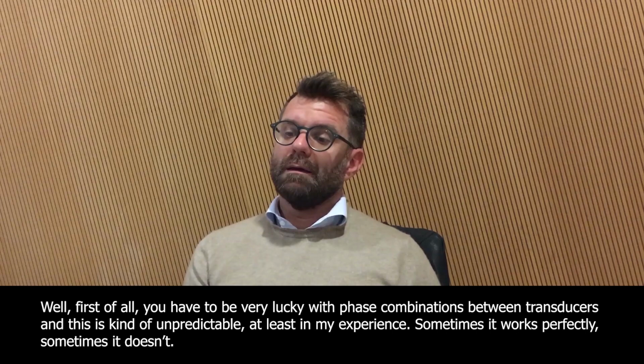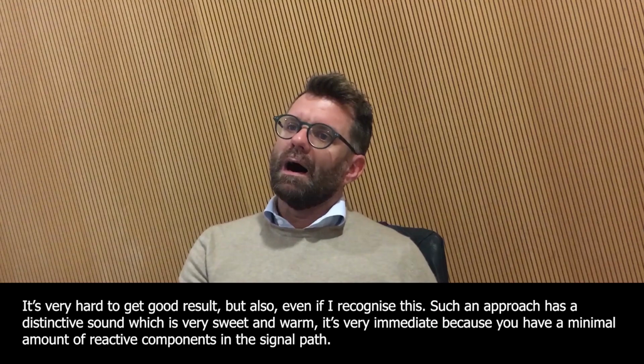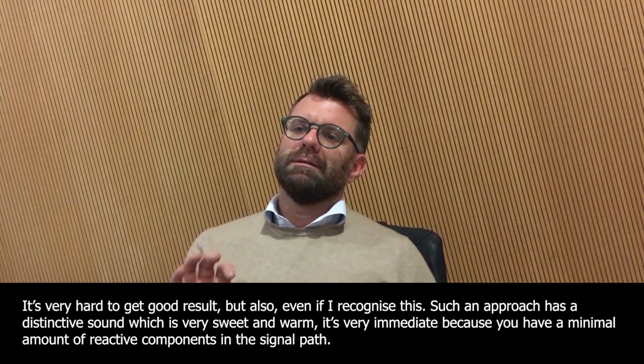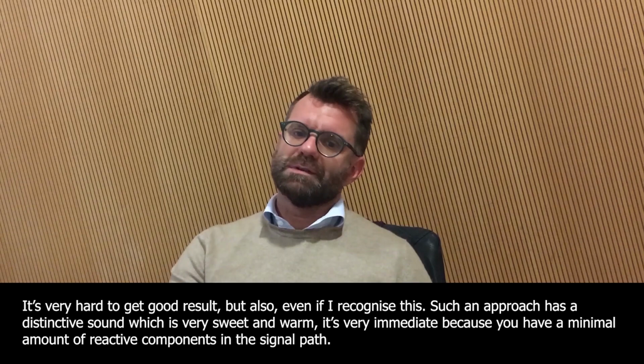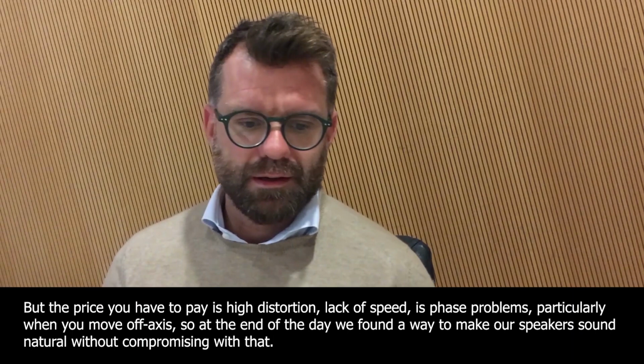Well, first of all, you have to be very lucky with phase combination between transducers, and this is kind of unpredictable, at least in my experience. Sometimes it works perfectly, sometimes it doesn't. So it's very hard to get a good result. But also, even if I recognize such an approach has a distinctive sound, which is very sweet and warm, very immediate because you have a minimal amount of reactive components in the signal path. But the price you have to pay is high distortion, lack of speed, phase problems, particularly when you move off axis.